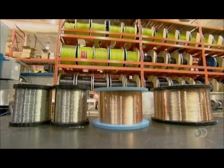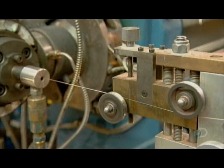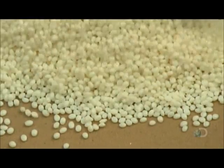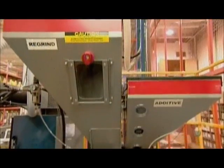At the core of those electrical heating cables are copper or copper alloy wires called conductors. An unwinding system feeds each spool of conductor to an extrusion machine. Extrusion machines force molten plastic through a die to form a particular shape. They load the raw plastic pellets into a receptacle called a hopper at the top of the machine.